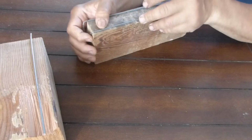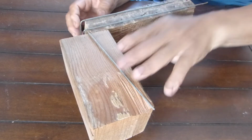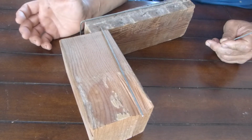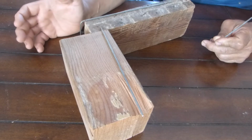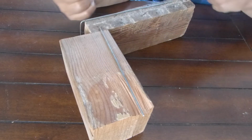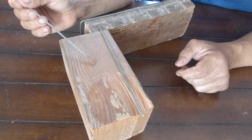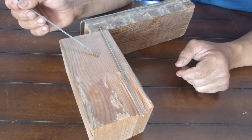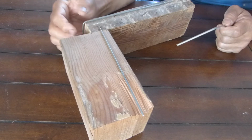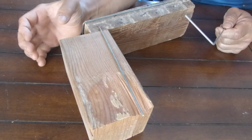This is 5/8. A very interesting note I'm trying to get across, sneak it in with you, is to look at this as a section. Section this off, and you'll see beams going all the way across. Where it intercepts on a column, great. Where it doesn't, let it fly. Then figure out, how's it being supported with that long span? And go, oh, it's being supported with the cross members from one column head to another. Clearly they line up. Facetiously, again, I'm stating that. They're offset, and their offset creates all types of drama. And that's where you get all this torque in the stack. Because they're not. Even if they were, you are still just dealing with the section again, and you're only going to see a little bit of 5/8 off the shear heads, and then it's going to switch to 4.